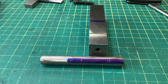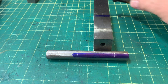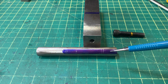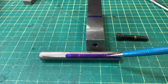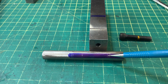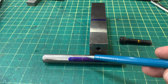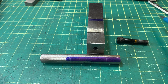It is now time to make a bolt. Although I could have used a pre-made 5/16-18 TPI bolt, I want to make something slightly nicer. This is the part that will thread inside the cross slide; there's a little relief for when we're going to thread it — this is going to be the shank bore — and then the rest is the head, which will get knurled, chamfered, and so on. That's how long this is going to be — time to go to the lathe.